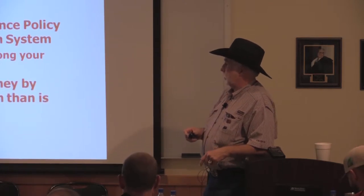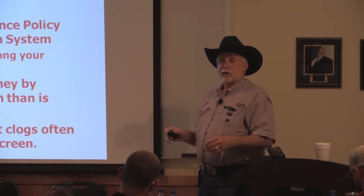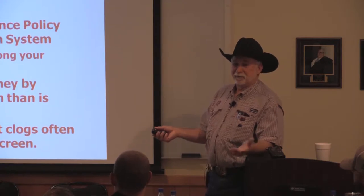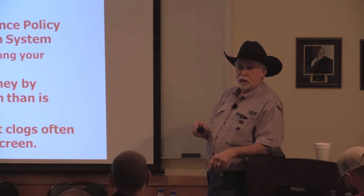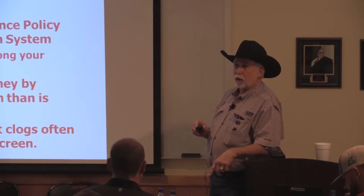And you never save money by putting in less filtration. And then I've had this too. Well, it was flushing all the time, so I just took the discs out. Bad idea. Again, the system was salvageable, but we still got sand in the system. If you go dig it up, it feels kind of like a beanbag chair. The good news is the sand is water-bearing. It's pure Ogallala.